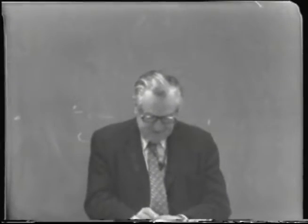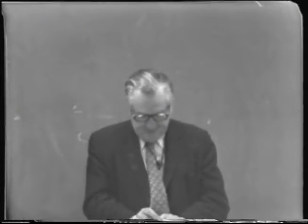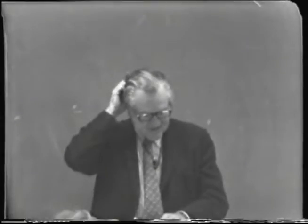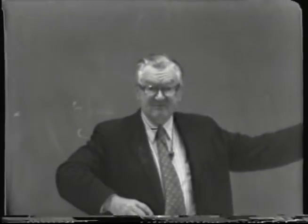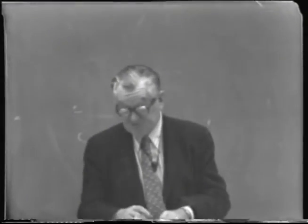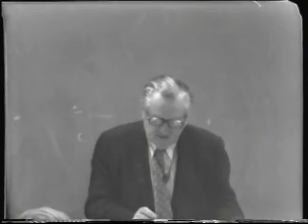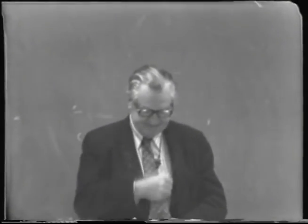And perhaps a fusel oil cut would be drawn off and returned back to the fusel oil column. But you see the distillate from the extraction column, the large middle one there, and that probably is realistically to scale, because if you're going to run a high volume of water through there, you've got to have a rather large volume, because you're going to pass through a lot of liquid, all the spirits plus all the water that's associated with it. So that distillate then is fed to the fusel oil column, and fusel oil is concentrated and separated.